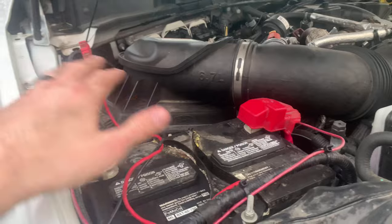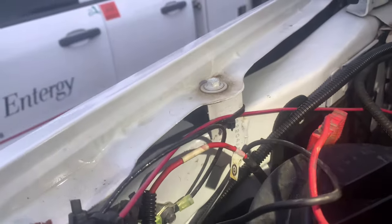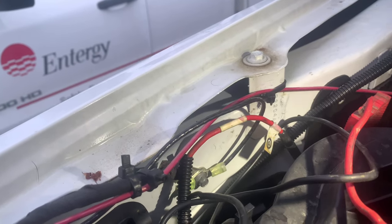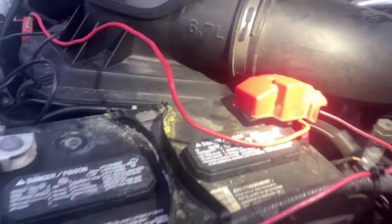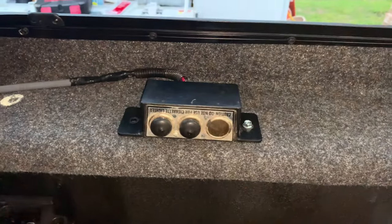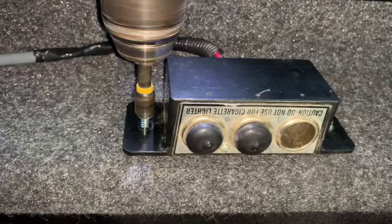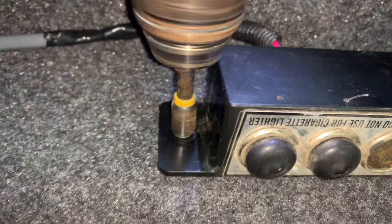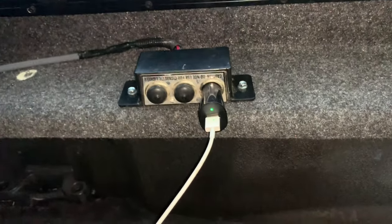I'm going to do that off camera, and then when I'm done I'll show you how it looks. I've got the hot leg right here tied onto that, and the neutral — see how I have both yellow squeezes back behind that nut right there? That's where I put the ground, the black leg. So that's it — ground, neutral right here, hot leg here. I got that one side screw right there. I don't have any pilot holes or nothing, just lined it up and let her go. Let's stick that plug in there. We got a green light, son!